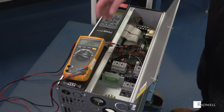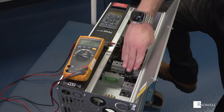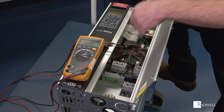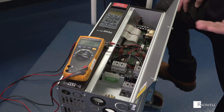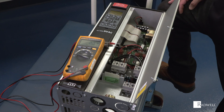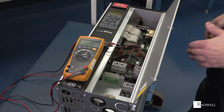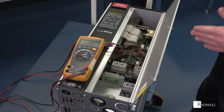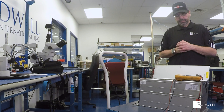If you're having an issue like blowing fuses, disconnect the output — on this drive labeled U, V, and W — to disconnect the motor and load. That eliminates the cables and mechanical load. Try the drive again and see if you still have the same fault — overcurrent, tripped breakers, blown fuses. Disconnecting the load further isolates whether the problem is in the drive or further along in the installation.